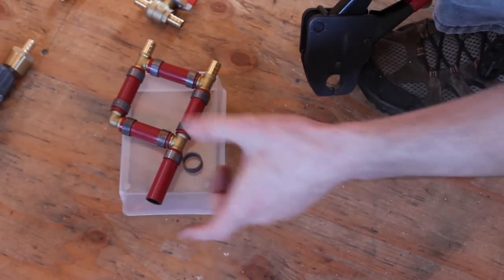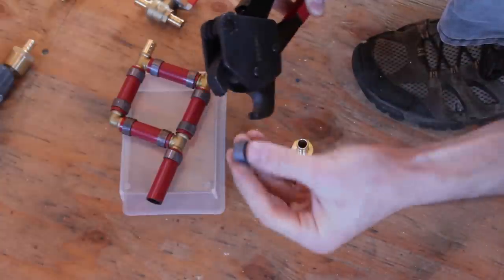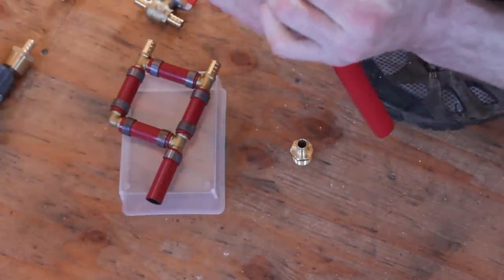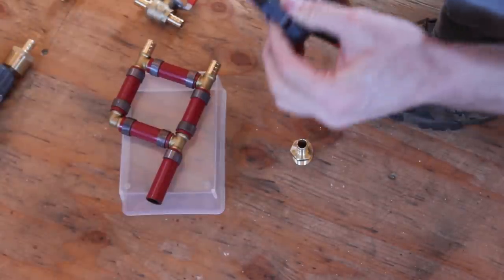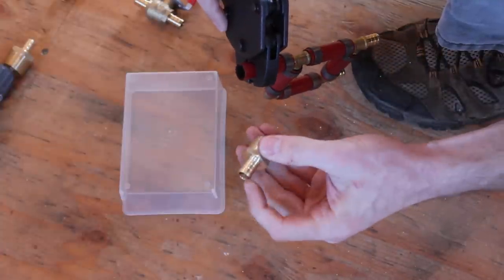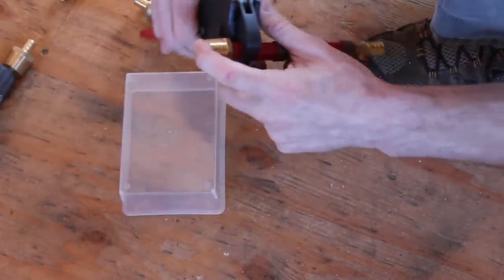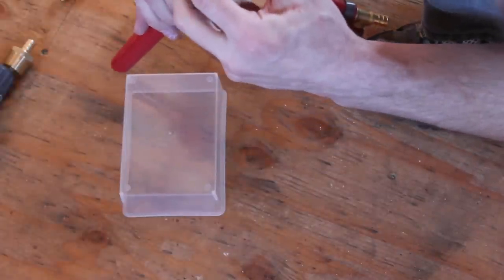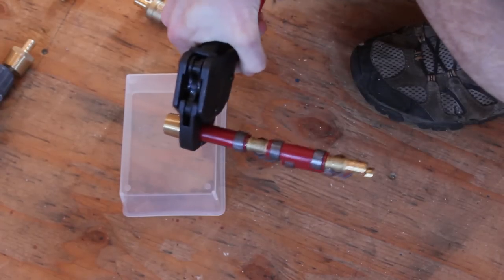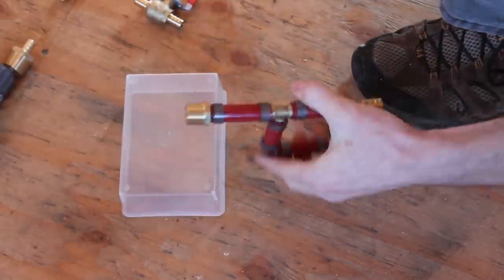I'm cutting all the pieces of pipe the same length so it's nice and even. I've got this tool — it was pretty cheap, about fifty bucks. The best way to use it is to take the crimp ring and lay it in the tool and let the spring of the jaws just hold it in place, make sure it's square and centered in the jaws, then slide the pipe in after. Then take the fitting and make sure the whole barb of the fitting is fully seated inside the pipe, then line up the pipe so that we're about an eighth of an inch back from the end, and then just crimp it down all the way.